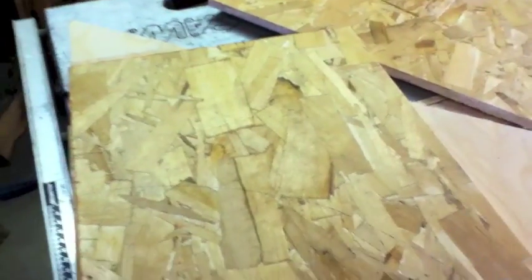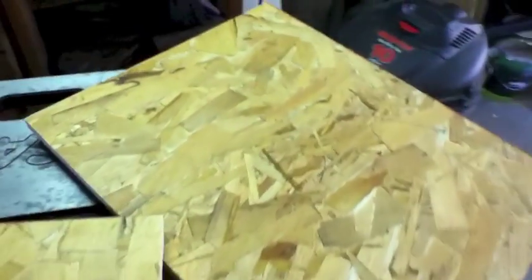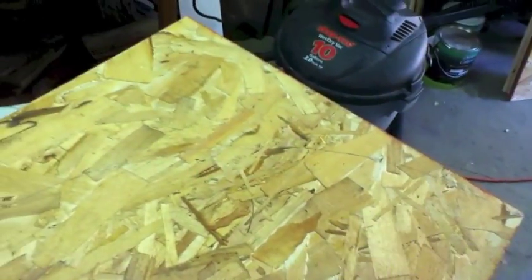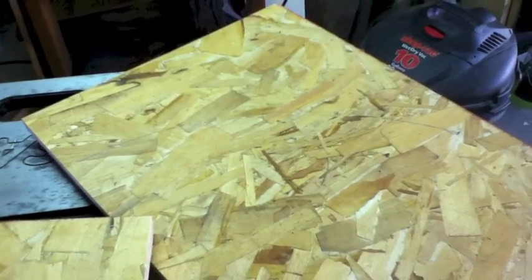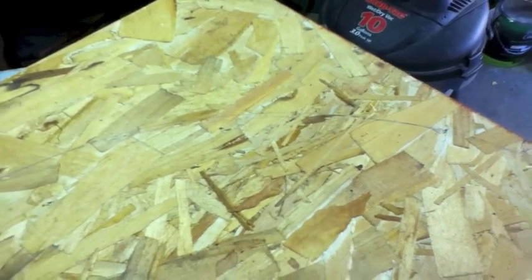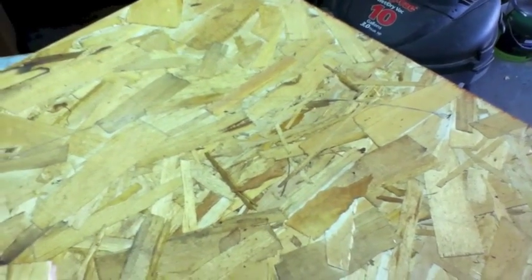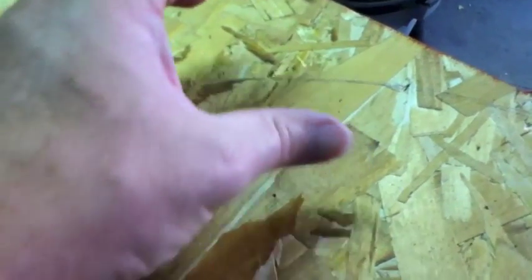Once that's done I run those over — I've got them all traced out. I've got small, medium, and large shelves. The cutout line is kind of doubled up on the large one because the pen moved on me; I wasn't holding it perfectly straight up and down. If you're making something super important, I'd highly recommend taking a scrap piece of one-by-four or similar, drilling a hole in it, and letting the pen drop through so it hangs straight down as you make your line.